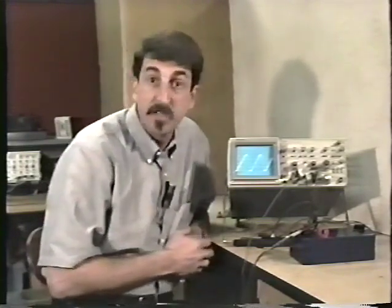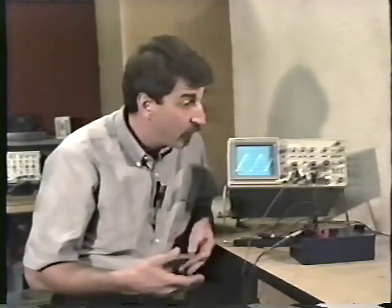It is helpful to be familiar with certain periods and certain frequencies because you come up against them again and again. For example, 16.66 milliseconds, the period of our AC power, happens to be the same period as the 60 hertz vertical deflection circuit in a monitor. And speaking of monitors, there's the horizontal section. That's 15,750 hertz, and you'll find that a horizontal period of approximately 63 microseconds is very common because that's the period of the horizontal deflection circuit in the monitor.